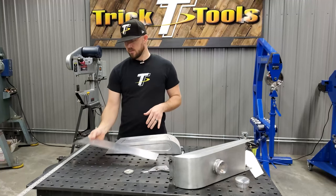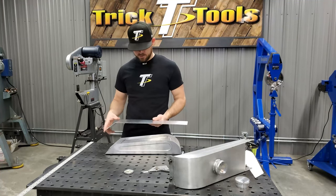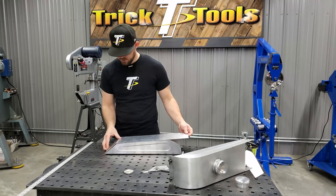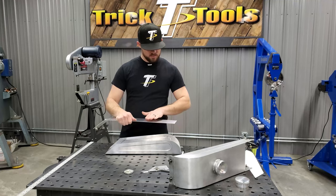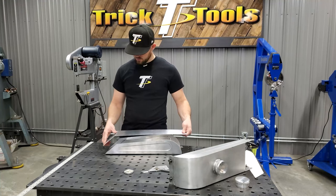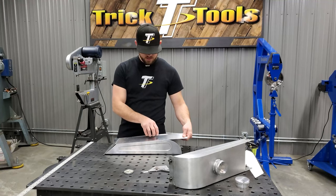All right, so right at the end of the day yesterday, we got this top panel trimmed to the widths that we needed to match the bottom here. Then we marked and bent the front edge here to fit our angle. So at this point, we're gonna mark out and lay out the radius here on the top to match the back edge. And then at that point, we're gonna figure out if we wanna do any kind of bead roll in here, and then we'll locate the gas cap